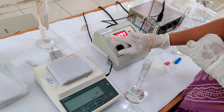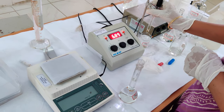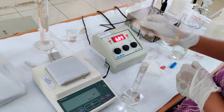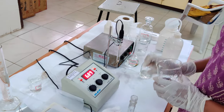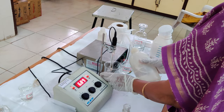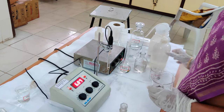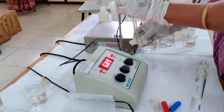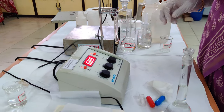I am now going back to standby mode and removing the pH 4 standard buffer. Rinse the electrode thoroughly on all surfaces. Then again, just touch the tip of the electrode with double distilled water, and place the electrode into the pH 9.18 buffer.